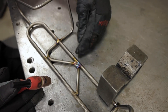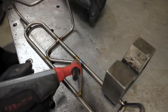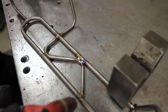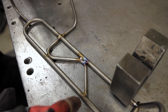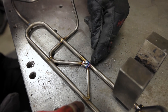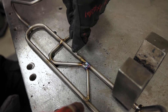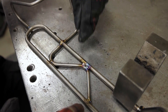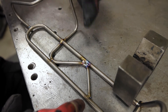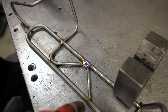When I was done, it was glowing orange. You really want to make sure that your cup surrounds the weld area. But this color here is kind of normal when you're welding titanium — it's not a reason to flip out or say you're doing it wrong. If you were welding titanium in an oxygen-free tank, you would have zero color — it would look the same as the titanium rod or part you started with. If you see race car guys with color on their welds, that tells you they're not doing it in an oxygen-free tank.